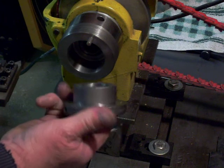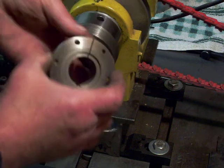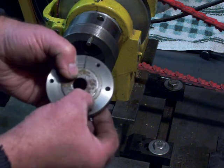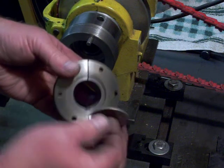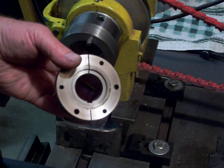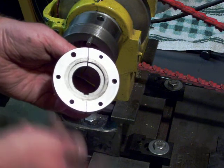There's a taper cut on here that matches the taper of the bushings. This one here, for example, I had used at one time — there's a small recess in here that I just cut out with a boring bar to make some specific thickness of washers. You can put a washer in there, clamp it down tight, face it off, turn it over and face it off, and have a perfectly smooth washer to whatever thickness you desire. Sometimes you need a bronze washer or a steel washer — it doesn't make any difference. Because these bushings are consumable, you bore it out for what you need and put it away, and another time you may bore it for something else or use it over and over again.